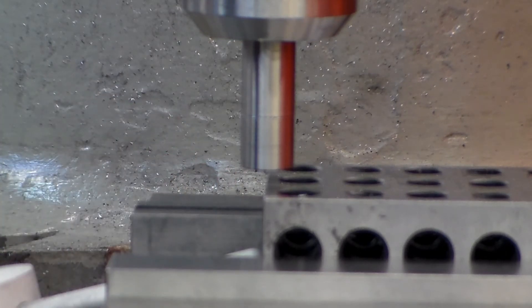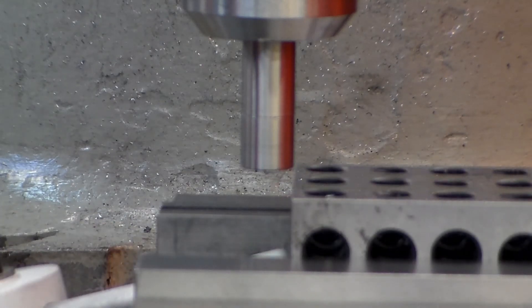The great thing about this is, if you forgot to do your .250 shift, your edge finder would look like this — and that's pretty obvious that you're missing something. Edge finding a part is very simple. Just follow these directions, double check your work, and you won't have any troubles with this.